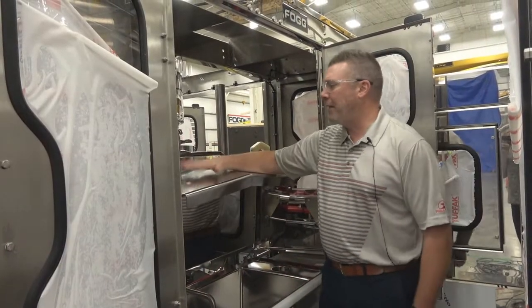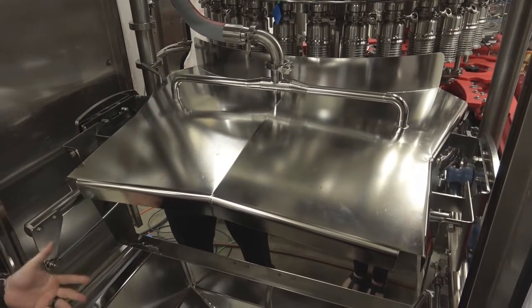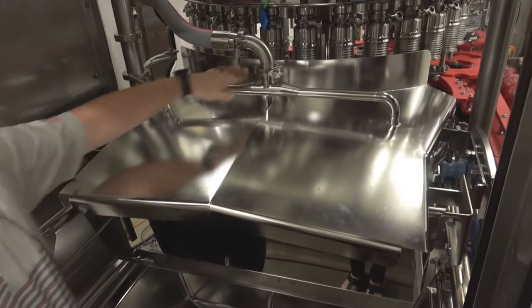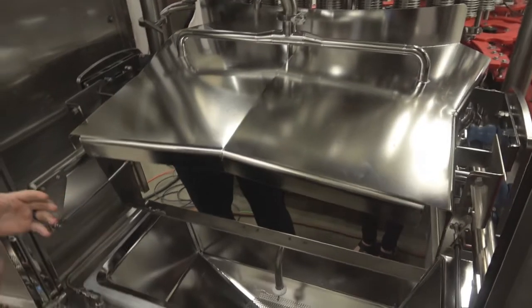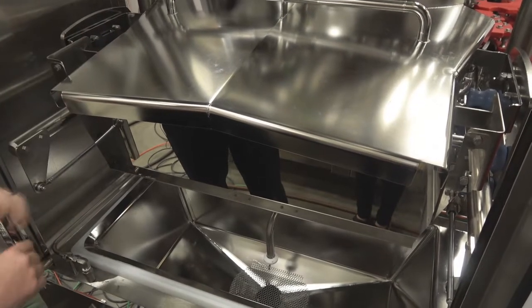One very effective and important part of this machine as well is our CIP trough. What its intent is, between flavor changes, if you don't have to stop the machine, or for CIP, if you don't want to remove the physical valves in the machine, this comes into play. It's accessible between changeovers or through flavor changing from the HMI. It's on a secondary set of cams that's separate from the physical filling portion of the machine.